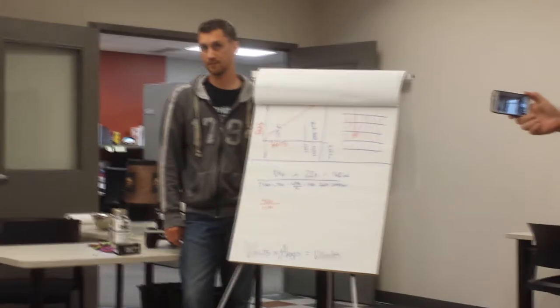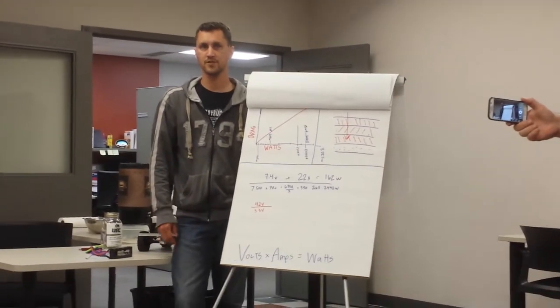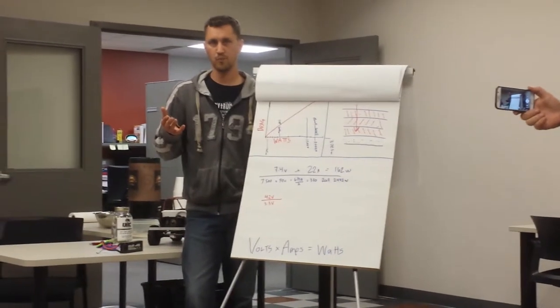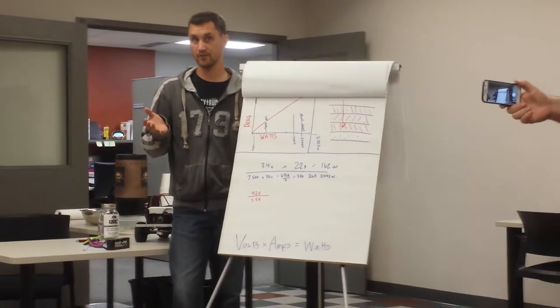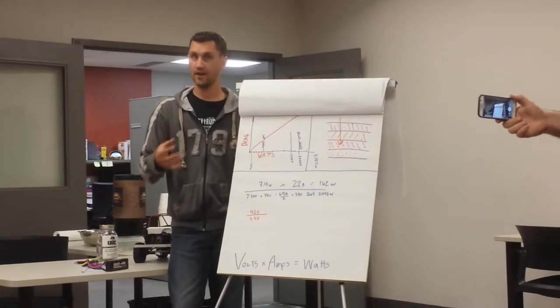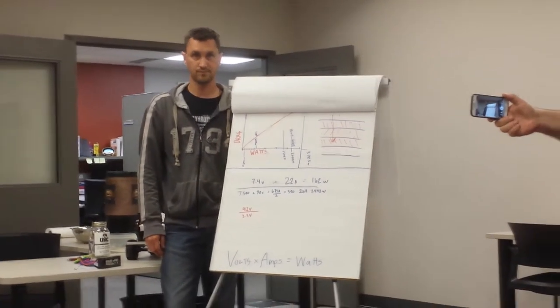It's not if it's going to happen, it's when is it going to happen. The pouches, are they any good? Like the LiPo bags? The LiPo pouch is made out of a material that's incombustible. So it's not going to keep your battery from burning, but it'll keep anything else from burning. You don't burn your house. The smoke will come out of it, and it'll contain all the heat, all the fire, all the problem. It'll contain it within the bag, and that's how you keep your house from burning down. Yeah, put them in a bag.